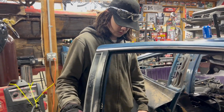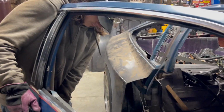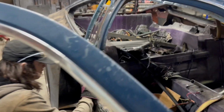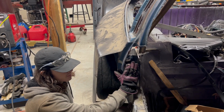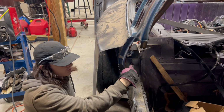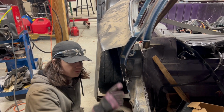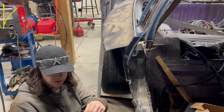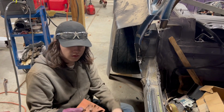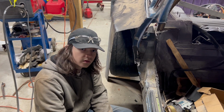Okay. Box 2x3, you mean? Yeah. It's like a bigger one. Yeah, that's pretty solid, too. That's kind of what you want for the door. And it'll just be kind of an angle here that'll extend out as far as it needs to be. A little flat space right here with a hole for the striker to go through, with a nut and a washer on the back, essentially. Similar to a plate, something that allows it to still be adjustable. Yeah, that's a good idea.